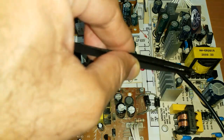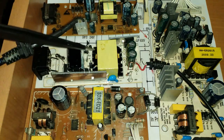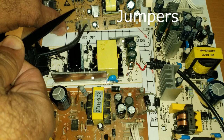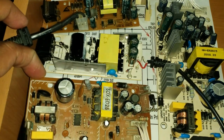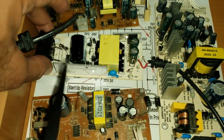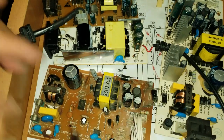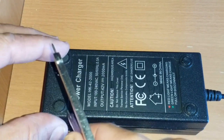After that I will discuss the secondary side — 42 volt output for hoverboard battery charging. Here I have a hoverboard battery charger and some other chargers. I will explain the SMPS and show other battery chargers, as some components are different. The main stages are: main input 220V, input filter, rectifier, inverter, transformer, rectifier, output filter. In between there is a controller and zero cross detection — I will explain everything.